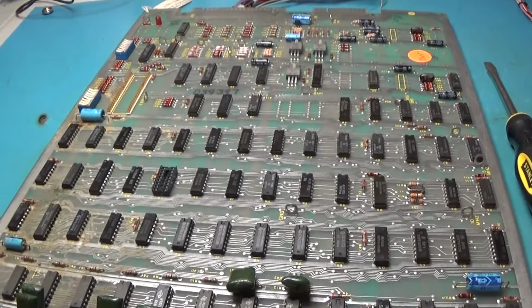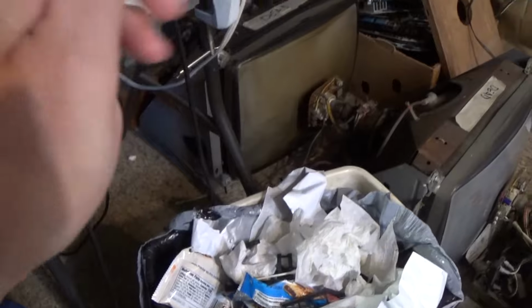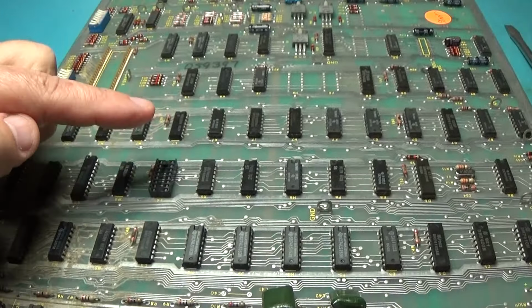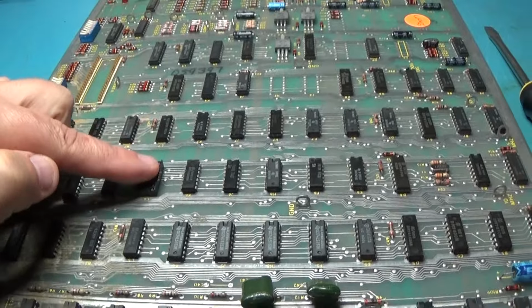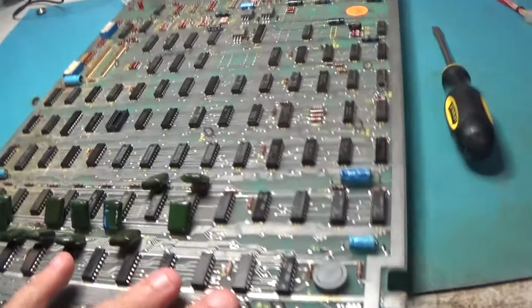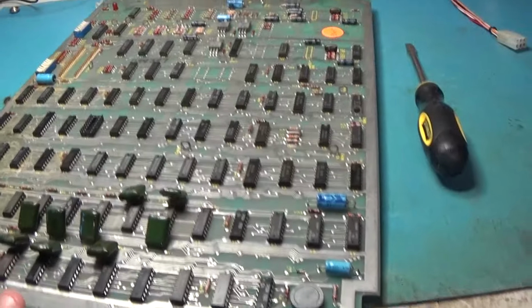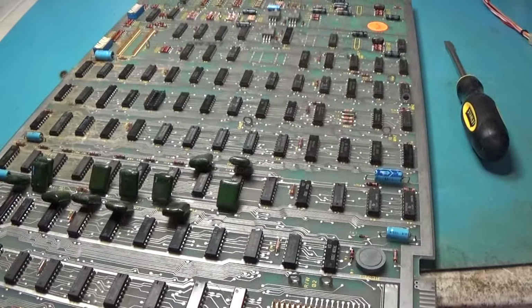All right, in taking this thing apart, I have discovered underneath that tape, well, yeah, there's no chip in there. I was thinking maybe it came up on the tape, but no, there's no chip here. That's the 8-bit bipolar ROM, the color bit chip, bipolar color palette ROM. So. Yeah, that's missing. Yeah, so that's a surprise. I got the socket tops popped up off of here. I'll go ahead and remove all of this stuff, clear out all of the solder, and then this thing needs to go in for a wash.